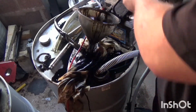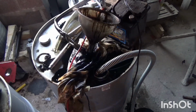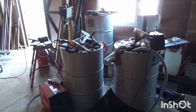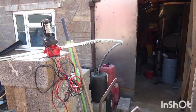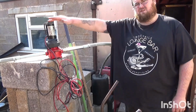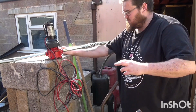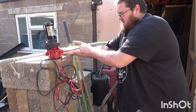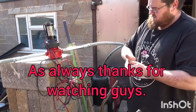Alright. And that's that. Full. Didn't take long. These 3 are now full. So, quick final rundown on this. I'm going to give it a day to let the bit of oil dribble out. It needs sealing better. Factory seals weren't that great. These tubes need PTFE wrapped around them before they go in, because they are allowing a small leak.